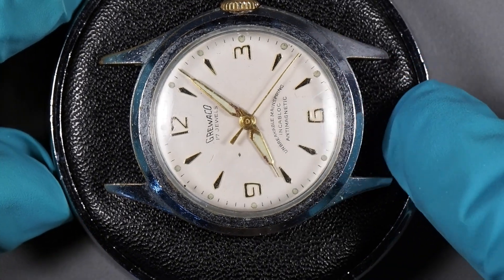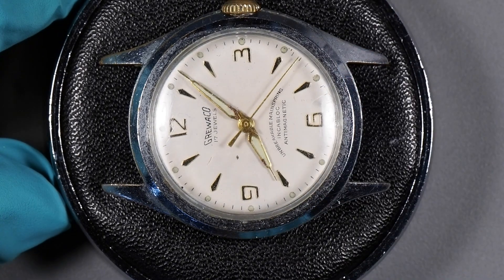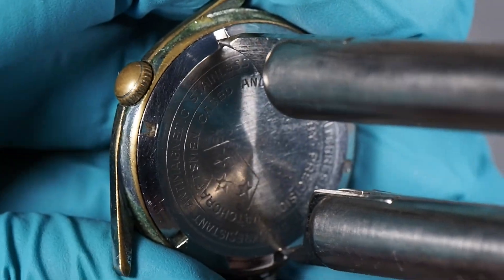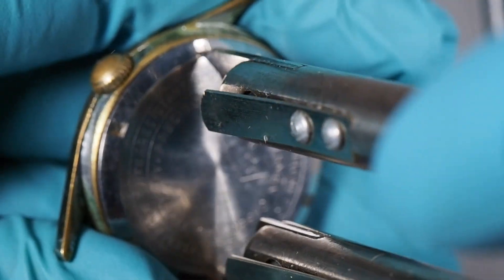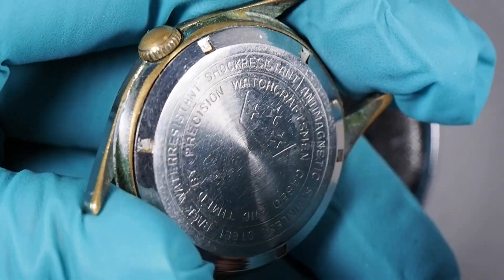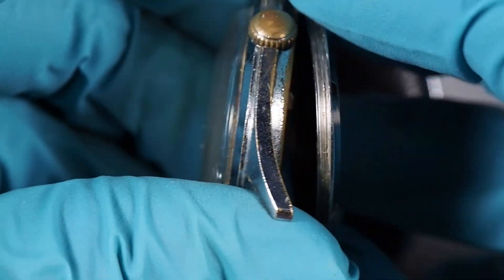I bought this one because it has a dial that is virtually identical to the dial on my Crawford watch, which is another one of these obscure Swiss watch brands. This one needs to be overhauled. It's running, but actually running really fast. It has very low amplitude, and low amplitude can cause a watch to run too fast because the balance wheel isn't swinging far enough. When it first arrived, I put it on the timegrapher to see what our starting points were. The readings were pretty dismal — plus 206 seconds a day rate, so it was running very fast, and 119 degrees of amplitude, which is extremely low.